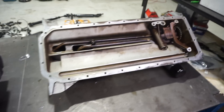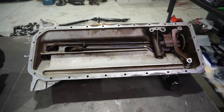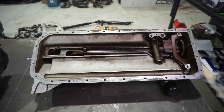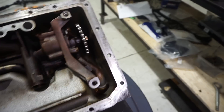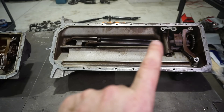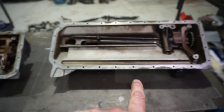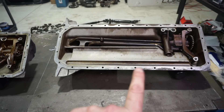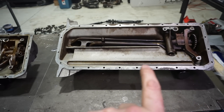They went to this distinctly different design. This is actually from a 3.2 liter car, and it differs in a couple of ways. One, it's a double pickup — the primary pickup is here. There's a secondary pickup down in here, a little mini sump. While it doesn't completely stop oil starvation, it does substantially reduce the chances under hard cornering. So this is what I'm going to be installing — an upgrade from the original design to a much better, more track-friendly design.